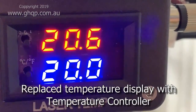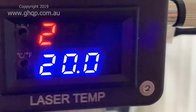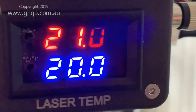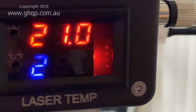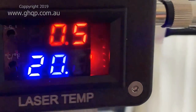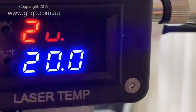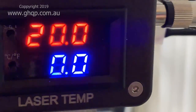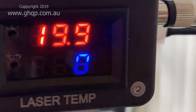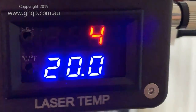When the temperature gets to about 21 degrees, the Peltier will switch on. When the temperature drops to around 20 degrees, the Peltier will switch off. I'm able to set these temperatures and the differential at which it switches via the settings on the controller.